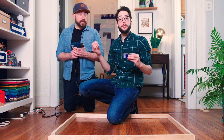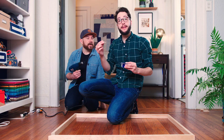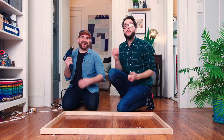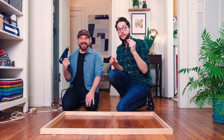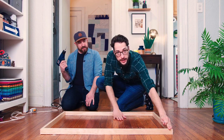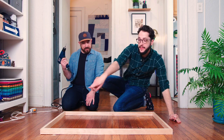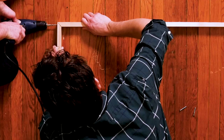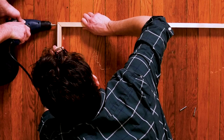When we were at the hardware store, we were looking for screws that were nice and long but wouldn't be too thick — that would split the wood. When you do drill the screw in, you want to be careful when you start to get to the end not to go too far, because that will split the wood. We're going to start drilling in our wood screws diagonally — starting on this end, then here, then here, and then there. It helps it all come together a little easier than going clockwise or counterclockwise.